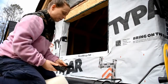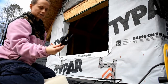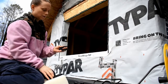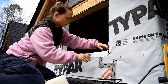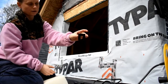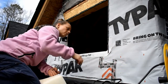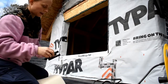Before we can set our window in place, we're going to put a few shims down at the bottom. I have these — they're like a big horseshoe and you can snap off the ends, so you end up with a small horseshoe. These are about an eighth of an inch thick, so you can stack them up as many as you need.